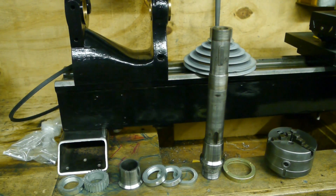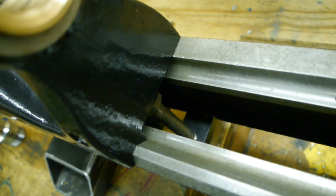Time to finish reassembling this old lathe. In this last part, 3 out of 3, I'm gonna reassemble the headstock. I just fixed the headstock to the bed with the long stud bolts. This way it won't tip over, so that makes the work a little easier.